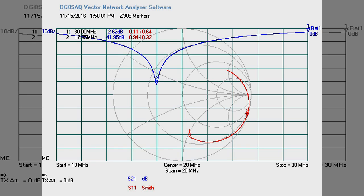Everything is normalized to a 50-ohm load. So it's roughly 50 ohms with around 15 ohms of reactive impedance. It looks pretty well matched — probably something around 50 ohms is what it's designed to terminate into and be fed with, which is what I am feeding it with and what it is terminated with.